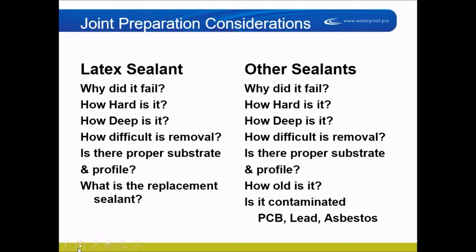That's not an easy situation. I've had friends doing work on projects that turned into hazardous waste operations because PCBs were found. They were cutting out and recaulking a job at one of the big colleges in the Cambridge, Massachusetts area. Some of the old-timers could smell the PCB oil burning when they hit it with a grinder. Sure enough it was contaminated, and they had to tent the whole building and take off stone. When you get to older buildings, you need to qualify your quotations and say this bid does not include any cost for testing or remediating sealants contaminated with regulated materials.